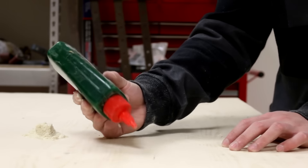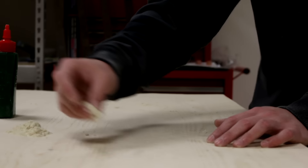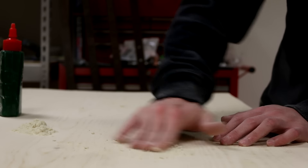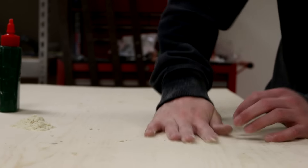There were some slight gaps in the top, so I just added some wood glue and then the dust from sanding to fill them in. This is a really easy way to get rid of any gaps — it can just be sanded smooth again when the glue is dry.